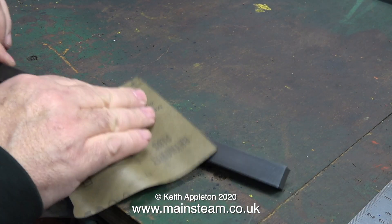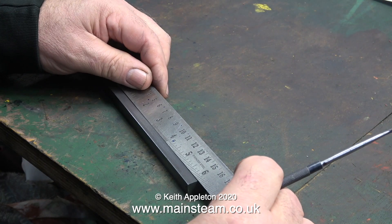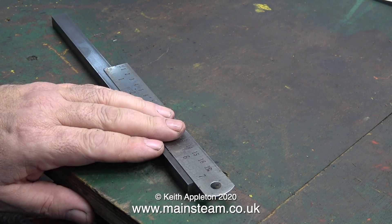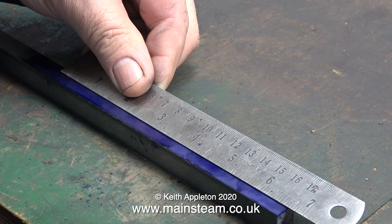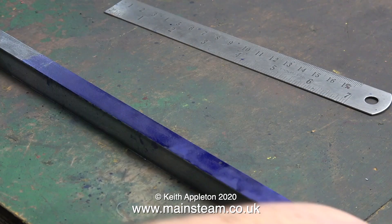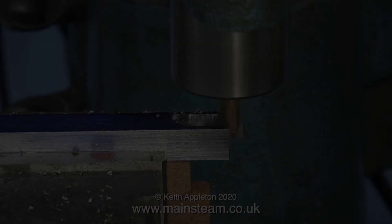With new pieces of steel from a supplier, you have to be careful because the edges are usually quite sharp when cut, and this is also true of the bar stock that comes with the casting set. Now the piece of steel that I'm going to use is clean. I can start the job, and the first thing to do is to cut the bar to length — but be careful, don't misread the drawing. The six and five thirty-seconds of an inch dimension is between the hole centers.